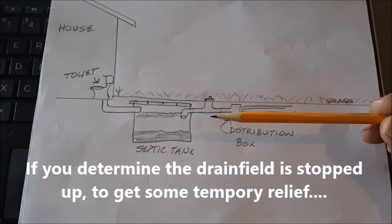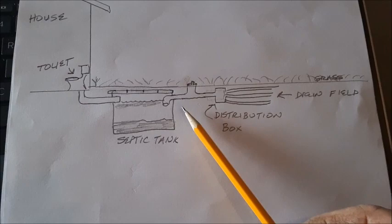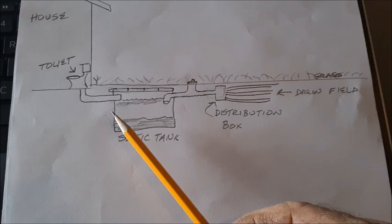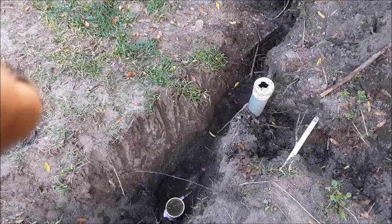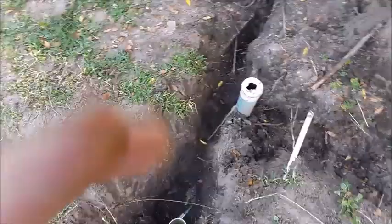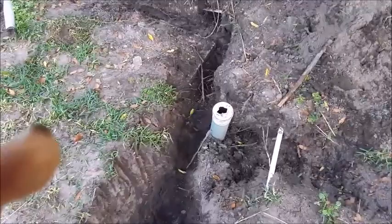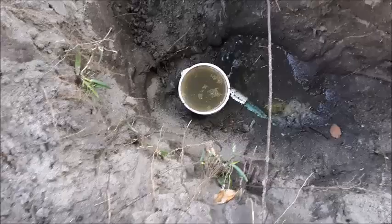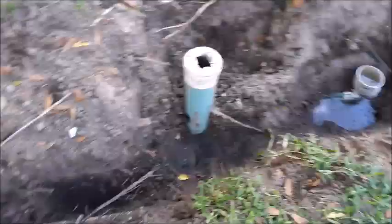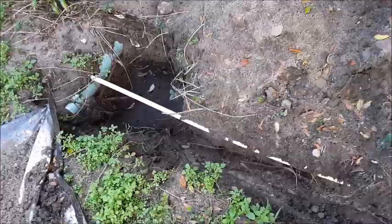If you're all stopped up right now and need temporary instant relief, come to the drain field side of your septic tank, dig up the pipe, dig a trench around the tank, and take a hammer and knock a hole in that pipe. The trench has to be below the level of the pipe, and you'll see all the water start flowing out and going around the tank in the ditch you dug. You can see on this one — we pulled the cap off the drain field pipe and the water is just standing there and goes down slowly. The hole in the pipe will only give you temporary relief until you enact the other solutions in this video.